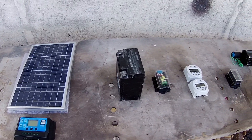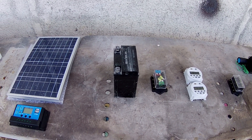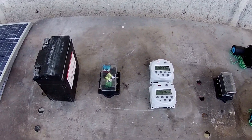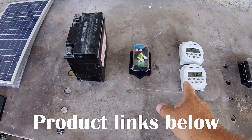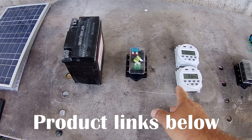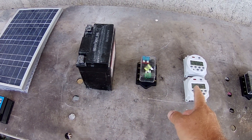Next I've got a battery, which is just really there for demonstration purposes — I will be purchasing a smaller one. Then I've got a fuse box. I'm going to mount one fuse box between the battery and the timers so that if there's any fault with the timers it protects the battery, and if there's any fault with the battery it protects the timers.